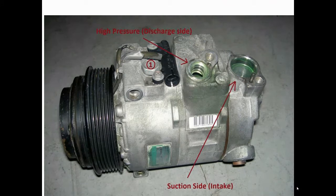There's an in and an out, just like an engine — intake and exhaust. If you put the oil in the discharge port and then turn the clutch, it's guaranteed to spill out. It's marked suction and discharge — that's what the S and D are for. A good tech can tell by feel: the suction port is the larger of the two openings. That's where you pour the oil — not in the discharge port.